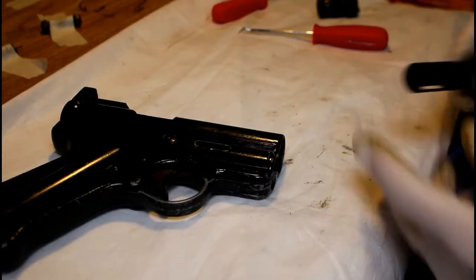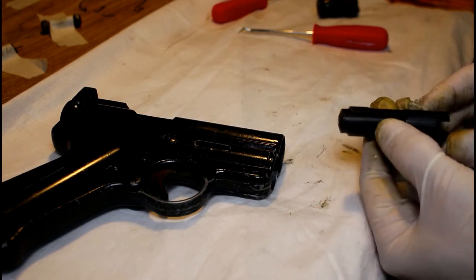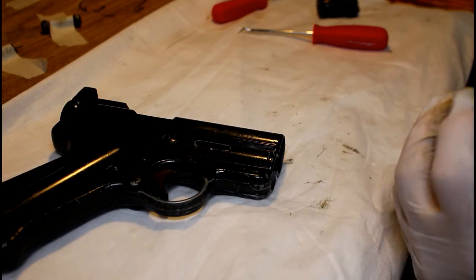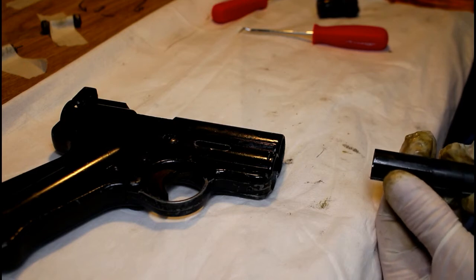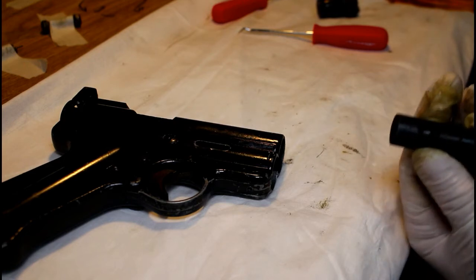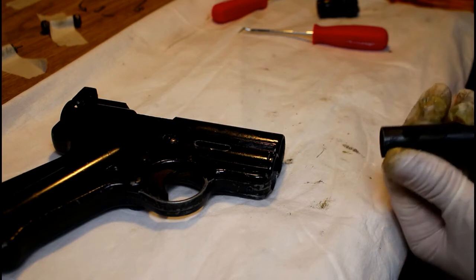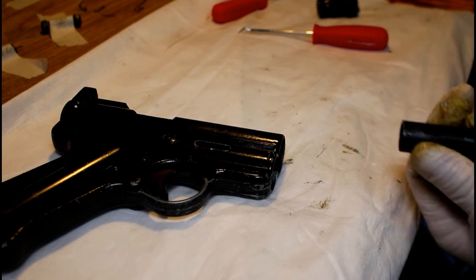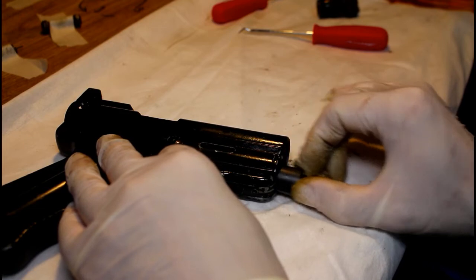The next part to go in is the hammer and the hammer sleeve, making sure that we've got this in the right orientation. So the hammer, obviously the part that's solid is facing into the valve, and it's going to slide with that hole there. The hole through the hammer there is going to be pulled back, or pulled forward more like, by the cocking threaded spindle that we're going to insert in a minute. So that goes in like that. Make sure that goes in, and make sure that you've lubricated that up as well.